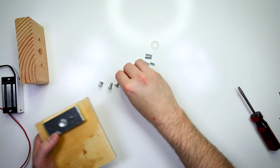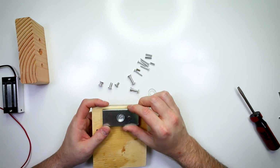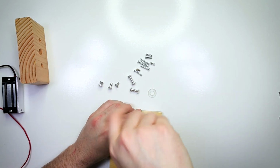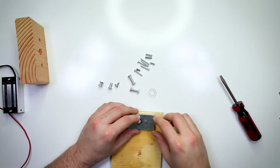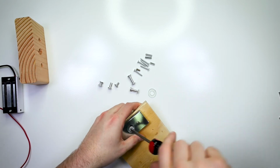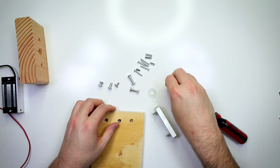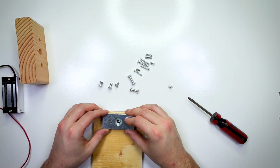Now you'll notice the one thing I have forgotten to do, and it was intentional, was put the rubber washer there. Because once you tighten this, it has no play to it. This thing cannot move once it's tightened down. That's one of the biggest problems people have online with a Maglock: they say, oh, it doesn't sit flush, I've got it mounted, and everybody's like, did you use the rubber washer? And they're like, no. That's one of the problems because wood with temperature and time swells and changes shape. So this allows for your plate to make corrections for that.